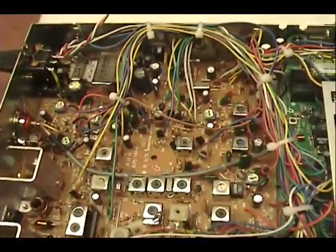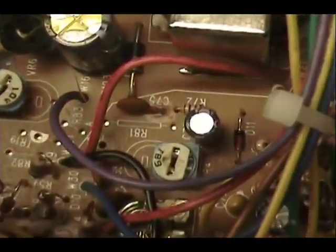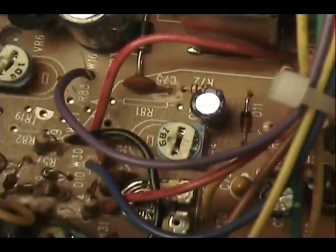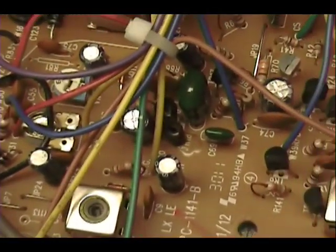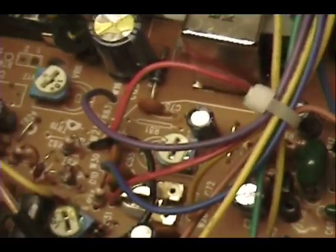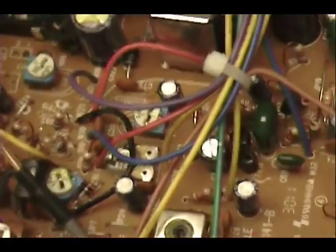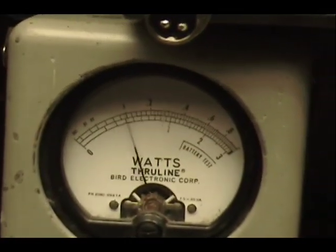I've got the power antenna hooked up with a microphone in it. You see the AMC control is only about halfway. The modification itself made it louder, so we don't really need to do much with it — that's about where it was from the factory. If you try to increase it, you get kind of a sawtooth waveform on the scope — it's kind of nasty. We've got plenty of swing with it where it is. I went both ways with it and it was best here.